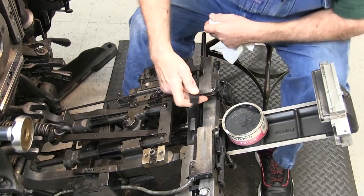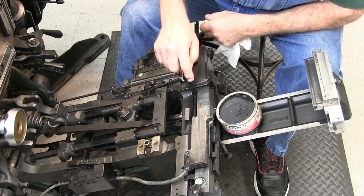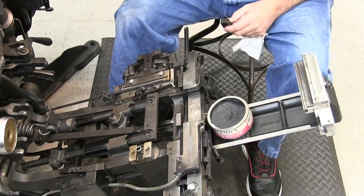You also want to do that to the inside edges of your jaws. You don't want to rock over this edge — you want to keep these edges as sharp as you can so that you don't get little fins coming up when you cast a slug, because any place there's a little opening, metal will squirt up into it.